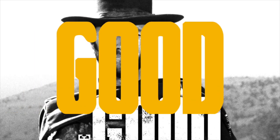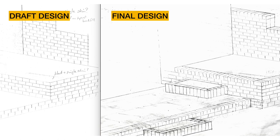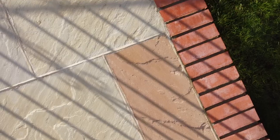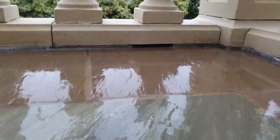Let's talk about what worked and what didn't — the good, the bad, and the ugly. Starting with the good: I stepped back the lower part of the patio where it meets the raised part, which gives better definition and is more interesting to the eye. Always do a drawing first — it's much easier to see what works. I also made sure the balustrade and step overlap each other. I like the soldier finish for colour definition and durability, and my drainage idea worked out very well.